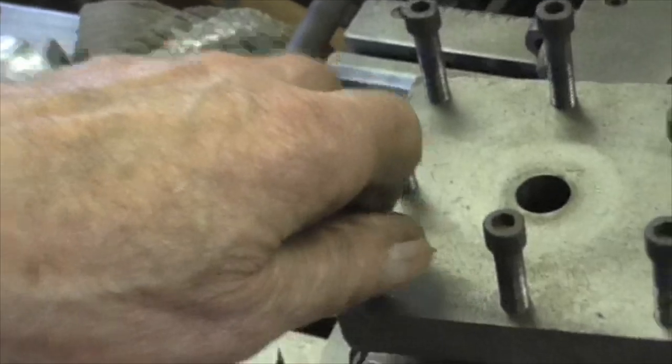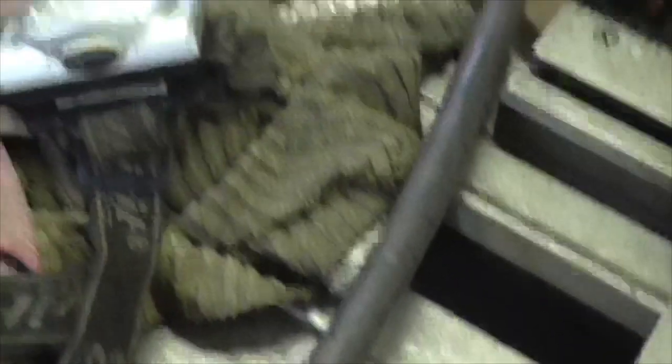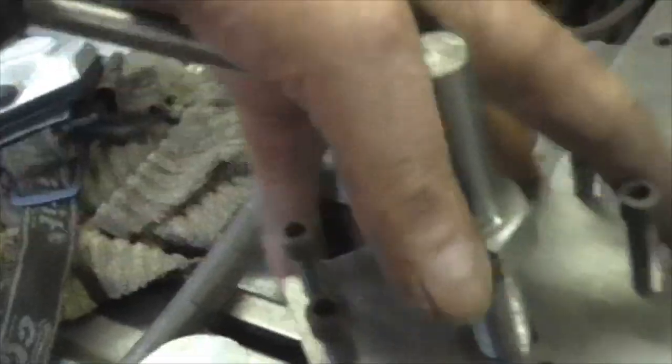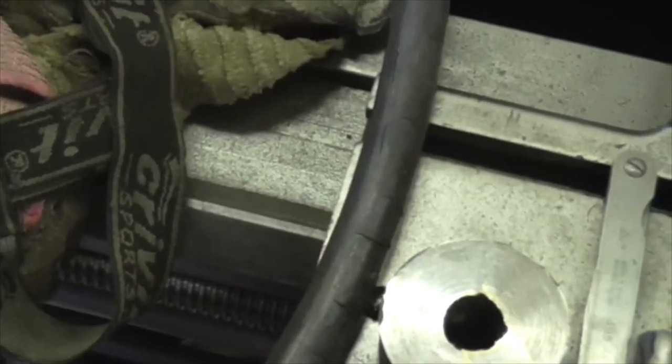I'm just tinkering because there's not a great deal I can do. I've just taken all these bolts out. I started to turn the ends down in the lathe but they weren't very happy, so I ended up grinding them down. Then I took this bar out of here, stuck it in the lathe, turned the end off, and welded this piece in just to make it look a lot neater. What I need now is a nice washer from under there, but that unfortunately is an assembly — a weldment or even a brazement.